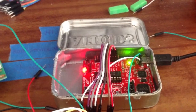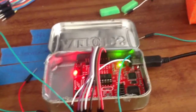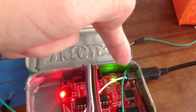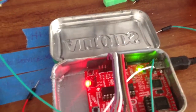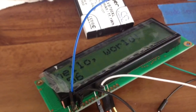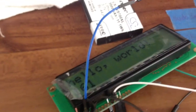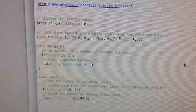Because this chip outputs 3.3 volts, I went ahead and connected two wires that go straight to the USB power, which supplies 5 volts — just enough to run this LCD. So if I were to ever take off this chip and install it on another breadboard or something more permanent, I'd have to find a power source that would supply it.